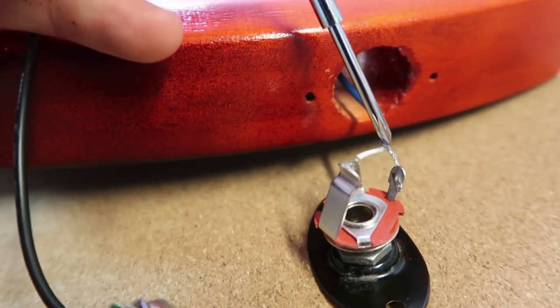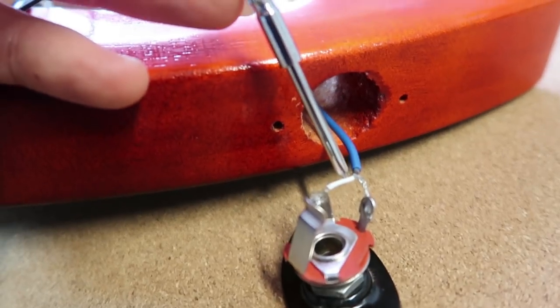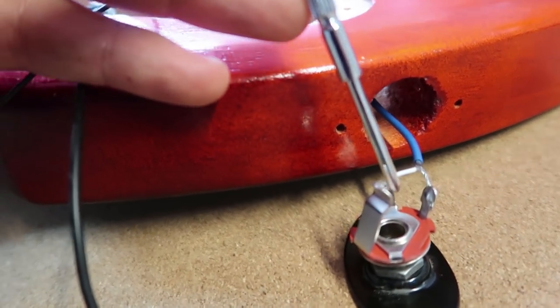I think the culprit is the blue wire, so I'm going to change that out. It looks like they took the insulation from this wire and connected it here, and then the actual inner wire connected here — basically using one wire to do two wires' job. Since I don't have an insulated wire to work with, I'm going to use two separate wires and hope for the best.